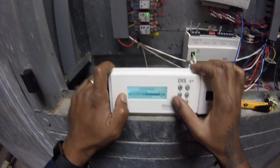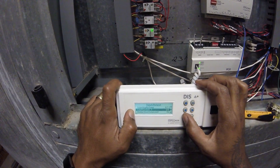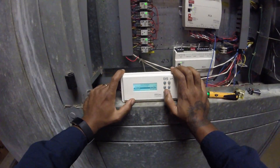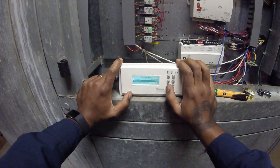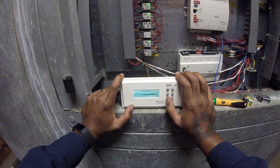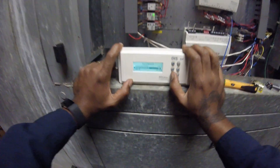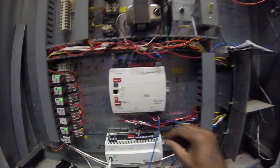Low suction is off. I don't think the low suction compressor switch is working — I need to check that. Because if that solenoid is not opening up, when that unit starts going into a vacuum, it just shuts the compressor off.